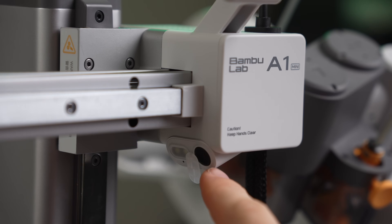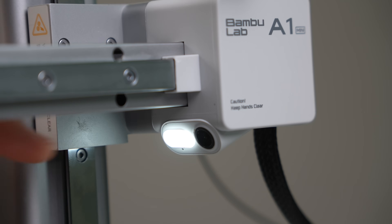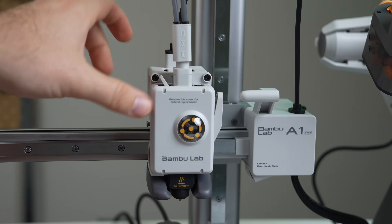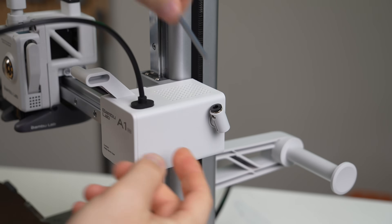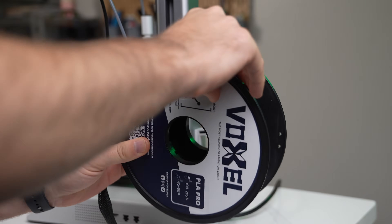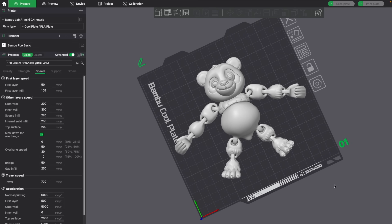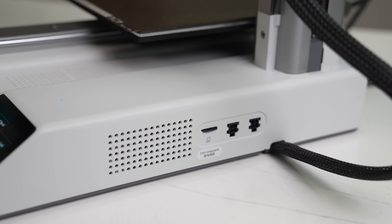On the right of the x-axis, there is a small light and camera for monitoring prints. The little cover on the light doubles as a diffuser, or it can be used to block the camera if you don't want it to have any view. There's also an arm for engaging the filament cutter and a reverse Bowden fitting for running in single spool mode if you don't have the AMS Lite connected. On the back of the Z-Tower, there is a filament spool holder underneath that Bowden fitting. For printing, options are over Bambu Cloud, in local LAN mode, or using the microSD card slot to transfer files.